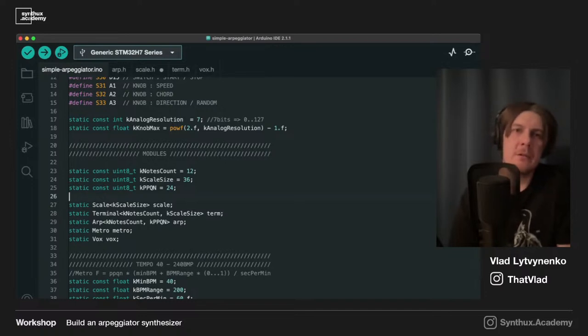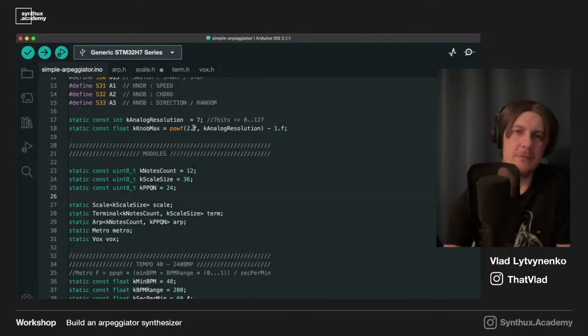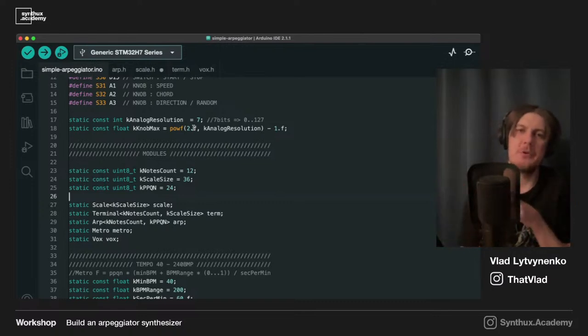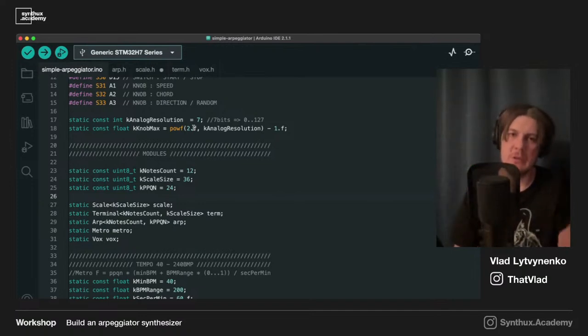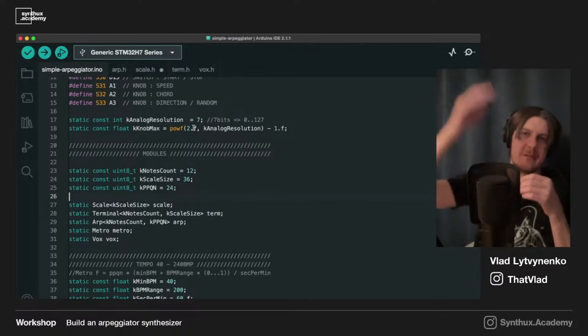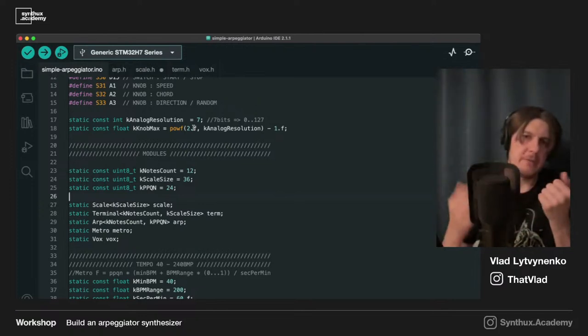That's why I said the arpeggiator direction is not up and down, it's forward and reverse, because it's not exactly clear, because it has more notes than that. Yes, the order of this relation between note number and frequency is broken at this point. That's why it seems that it plays in a different direction. But in fact, if you input there, frequencies will step up according to the note number. It will play up or down or random if you need.